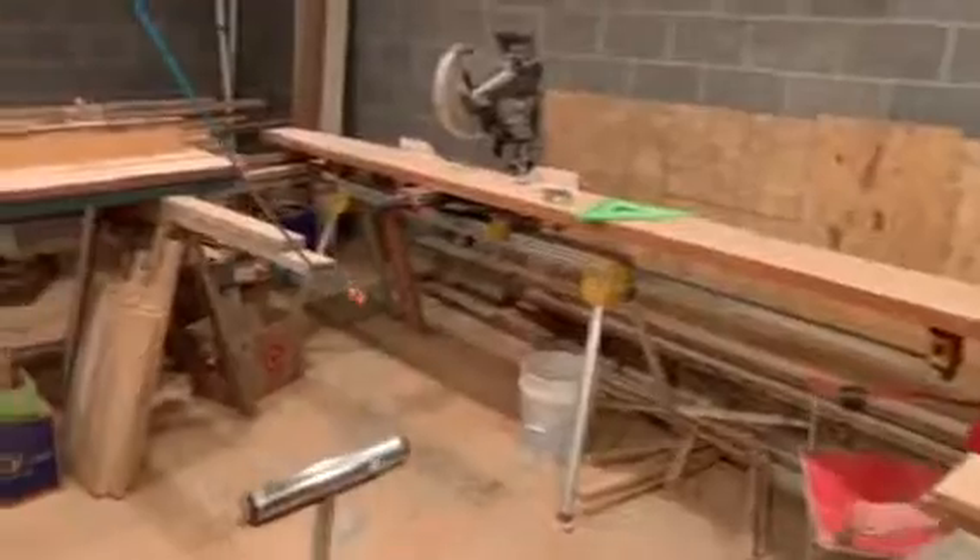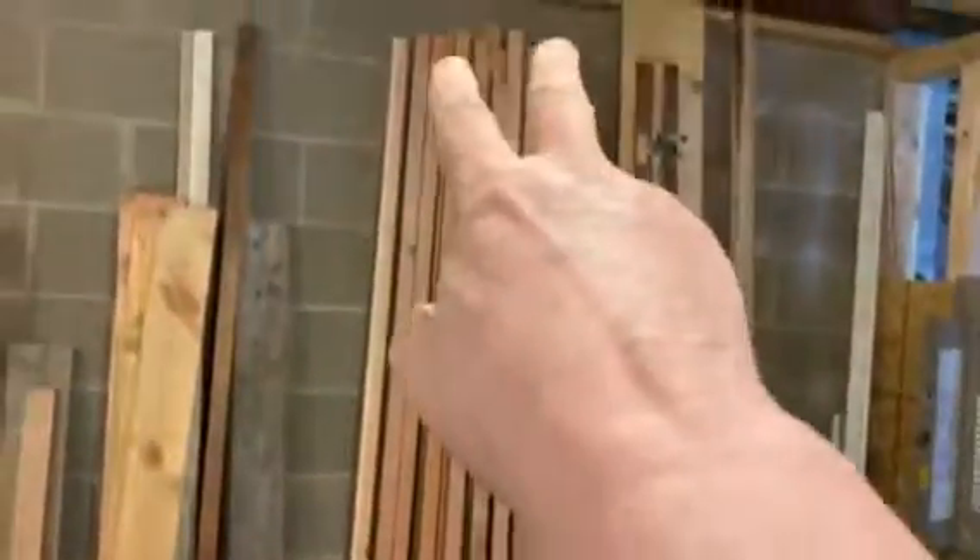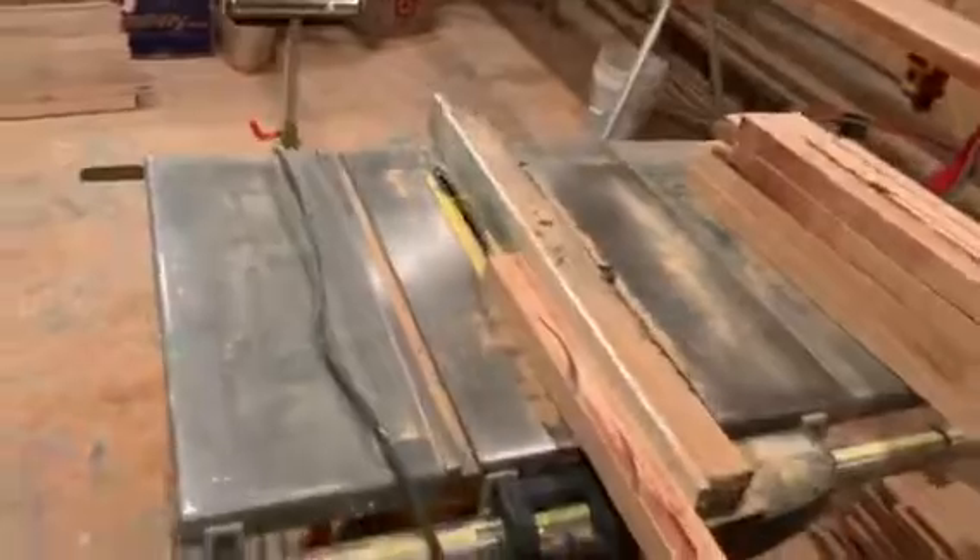One of the things I have to do — some of my fill-in work — is to build stiles now that I've got the rails and the kickplates done. Those are stiles: boards that I'll glue together for interior doors. One of the things I need to do is cut down the cherry planks — this is a cherry plank right here that I have on the saw.